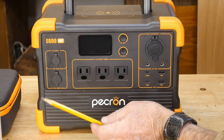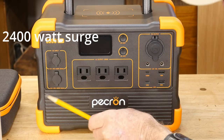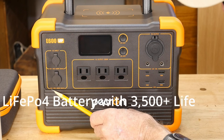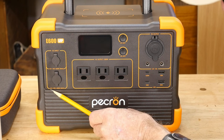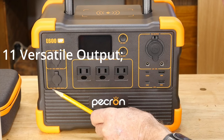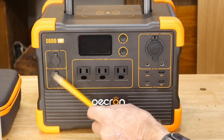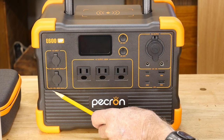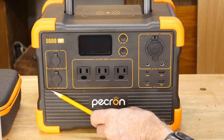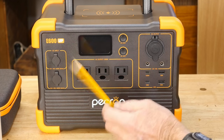Here's the big caveat — I'm going to try to explain this. For solar, this is technically running from 32 volts to 95 volts. Now I was at 27 volts and charging, so not really too sure what happened there, but around 32 volts is ideal or higher up to 95 volts, which means you can run 400 watts. The higher voltage is going to keep the current or the amps down so things don't get hot on you. So this is really a very unusual setup, but if you have some commercial panels laying around, or even the portable panels that are out there, this is designed to deal with that situation and give you fast charging — it's really a good thing.